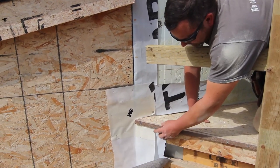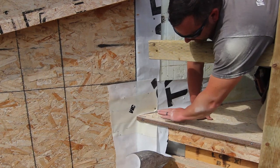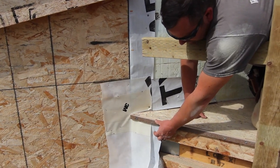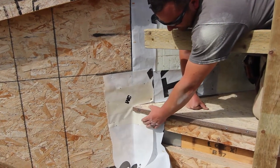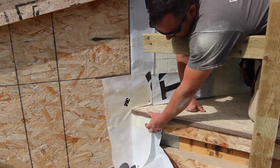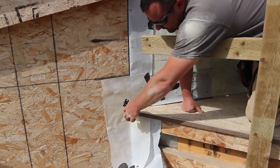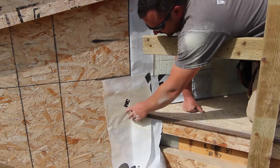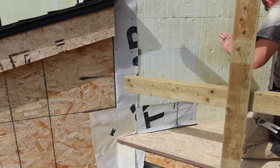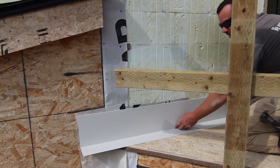This you might be able to visualize better. This is that five-eighths plywood I was talking about, seven-eighths tall. The drip cap is going to come over and come down two inches. What I like about that is all my detail work — this two-inch drip cap sits like that, we've allowed for siding to tuck in underneath, we've protected our inside corner. Same as the other side. I'm just going to flush this to my rough opening here.